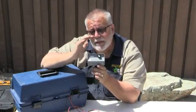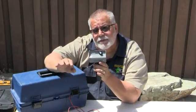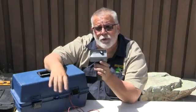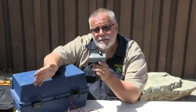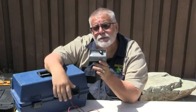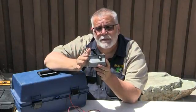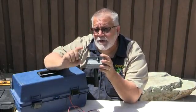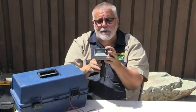A lot of times gophers go over to the wire because the buzzing noise from the electricity going through to the solenoid irritates them. Any rodent — prairie dogs, gophers, squirrels — will chew on it to stop that buzzing, which then creates an open wound in the wire. That open wound means you don't have good enough current — you don't have 24 volts going out in the field.